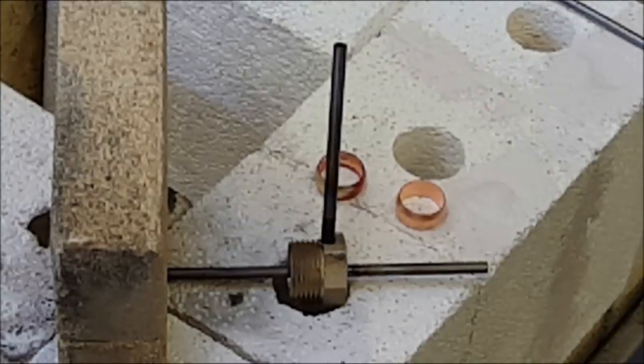This is the first step in building a reactor with through feed for gas and in this case for high voltage electricity. You can see here I've got a standard 12 millimeter high pressure pipe fitting and I've bored it a three millimeter hole for a pure nickel electrode which runs from right to left in this picture all the way across, and at right angles to it sticking up in the air at the moment is a piece of stainless steel pipe which is connected with the inside of the fitting and will be the gas feed.